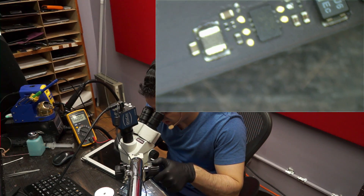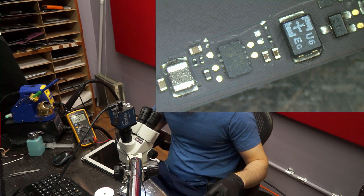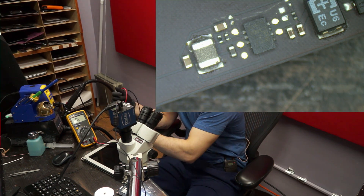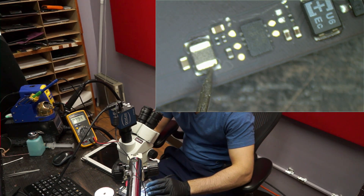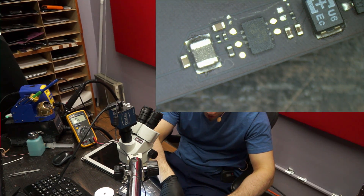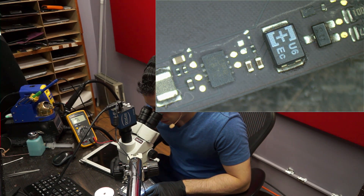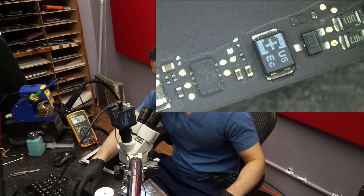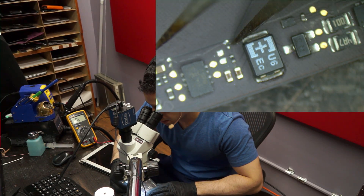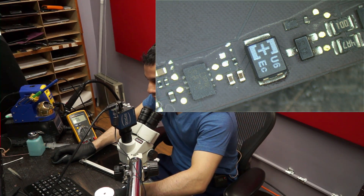Let's make sure it's in focus. I don't see anything wrong with that. Let's see if we have a short to ground. Put the multimeter in diode mode, red probe on ground, black probe on PP3V42 output. There's no short to ground over there, but it's not creating 3.42 volts. This area doesn't look very clean to me — it looks like somebody had their way with it. I want to see what those areas are for and if they actually go to anything.